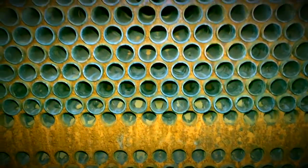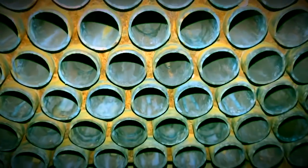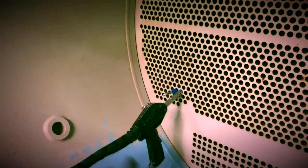Here in the evaporator marine box, you can see these tubes that are rolled in — they stick out, which creates turbulence when water runs through. When dealing with an open loop like a condenser loop, that untreated water will tumble around and corrode it. Here's an example of one that's had the epoxy treatment done — you can see it's brought the face of the marine box flush to the tubes and it also protects from corrosion. This is what we're going to pull open tomorrow to confirm the treatment was completed.